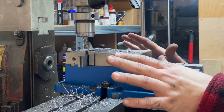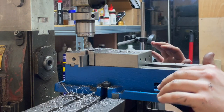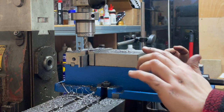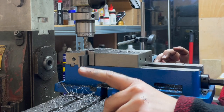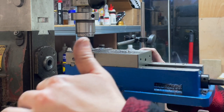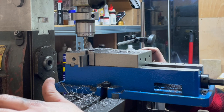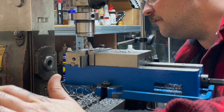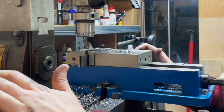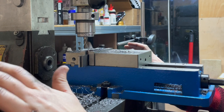Since that last bit of machining I'm now leveled to take off the final cut, but the surface finish hasn't been great — it's not terrible but I think it could be better. Using tips from John's workshop I've tightened up the gibs on both axes of the table, though I think I could probably do with loosening one that was a bit tight. I also need to do it on the vertical knee. I've also got the jam nut in here, so let's see what kind of surface finish we get.